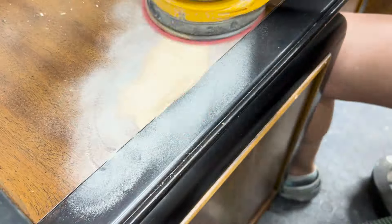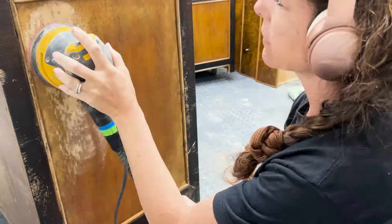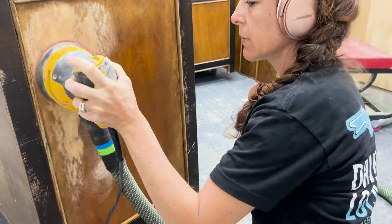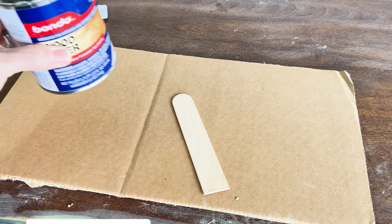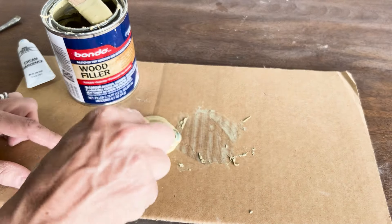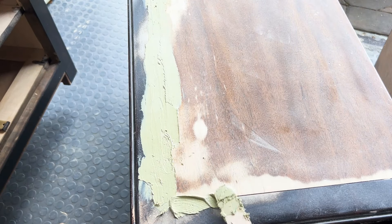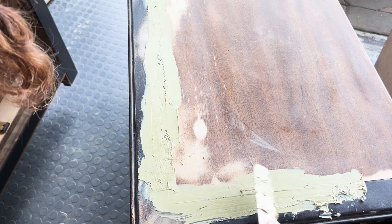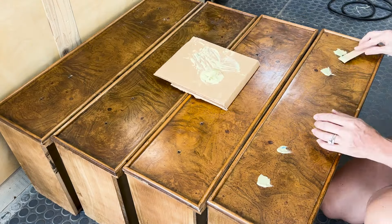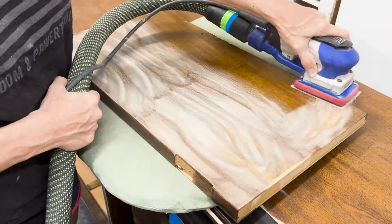Now that they're clean, I'll start repairing the veneer. I'm sanding each spot until it's level with the surface — even if that means sanding all the way through the veneer to the substrate. The goal is to get a level surface. Because I'll be painting these pieces, I can use Bondo to seal off where the substrate is exposed. Bondo is a two-part wood filler that dries rock hard in about 20 to 30 minutes, but it sets up quickly so work in small batches. It has a noxious smell, so wear PPE and ensure fresh air. I'm also using Bondo to fill the old hardware holes, then sanded everything down and gave it a scuff sanding with 150 grit to get it ready for primer and paint.